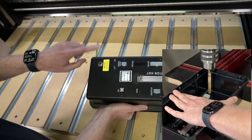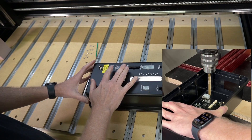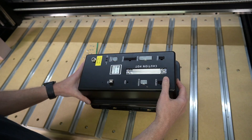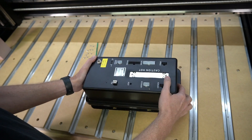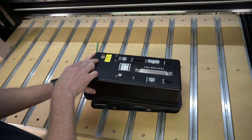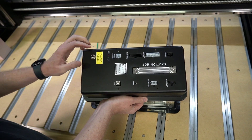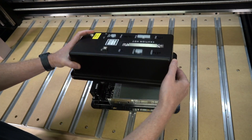I went ahead and drilled a hole into my controller — I would not recommend it unless you know that you are beyond the warranty level. This involves modifying your machine, so if you don't want to modify it just yet, just plug that in, run these two wires underneath the cover, and plug it in from the side. Once you're comfortable, you can go ahead and drill a hole right through it and attach the connector. You just need a 12 millimeter hole, and that's what I've done on this controller.